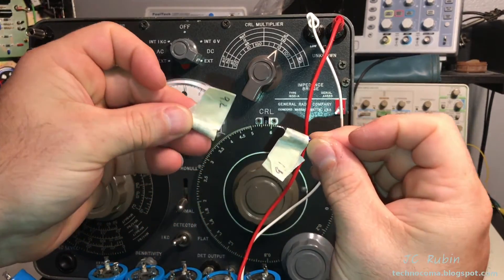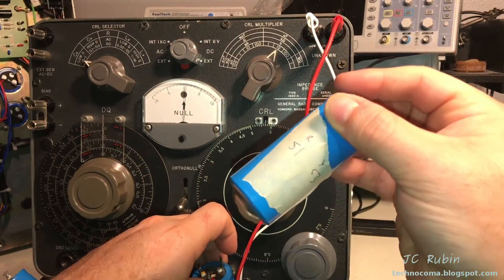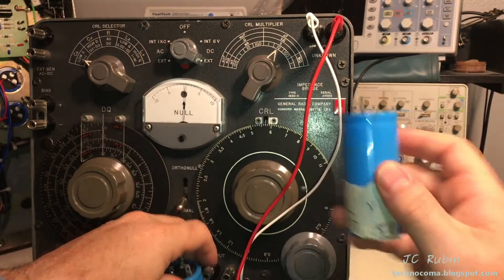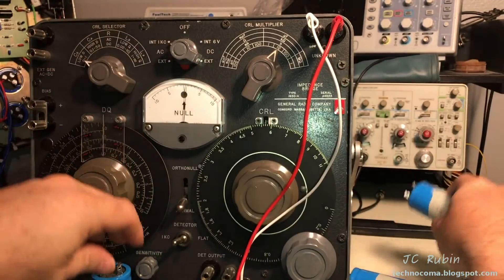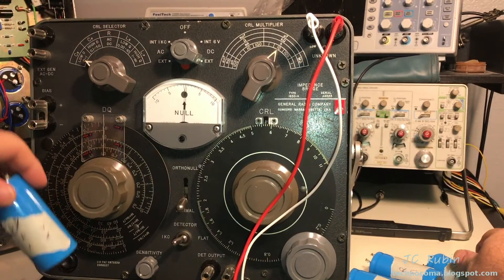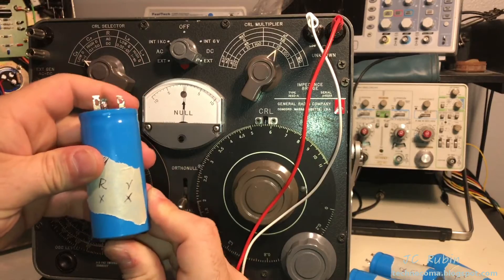These are 9.1 and 9.2 for a 10µF cap - that's good. For the 50µF caps I'm showing 51, 53, 57, 53, 54, 52, 51, 51, 54, 54. This is the only one I could not get a reading off of - it's showing dead. It's going to be interesting to see how these perform.